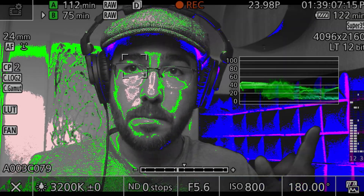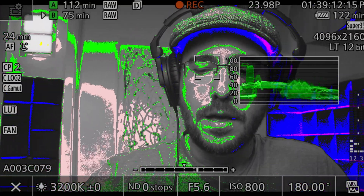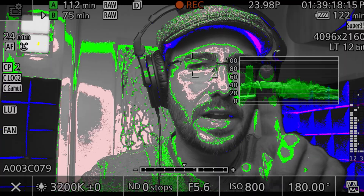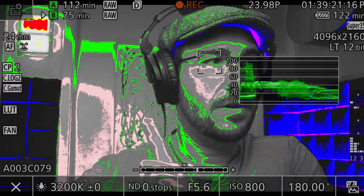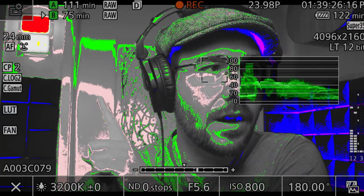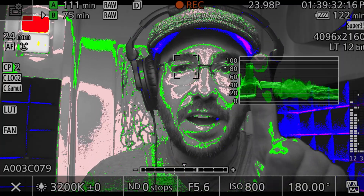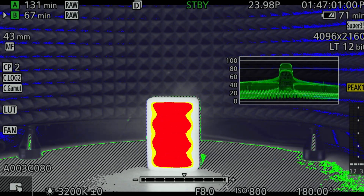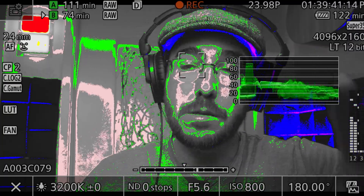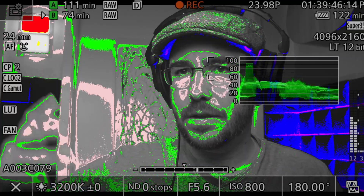I'm going to move over so you can see something that's going to clip. I have these two little lights in the corner, and I'm going to watch the waveform as I start to move it. Right now it's starting at about 81, 82%. But as I bump this up, you can see it's starting to turn red. I'm going to max this light out to 100% on its scale. And you can see on the waveform monitor, I clip at about 85–90% IRE — not at 100 — which means this waveform monitor will not accurately match the scaling of older Canon EOS camera systems, the C100, C200.